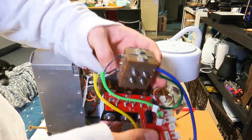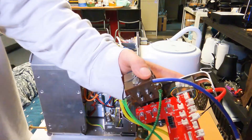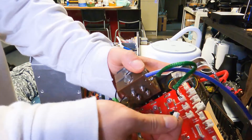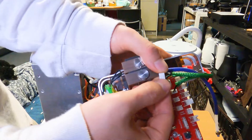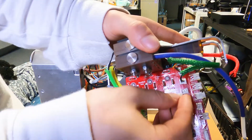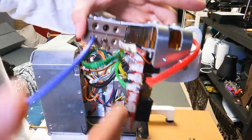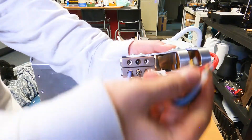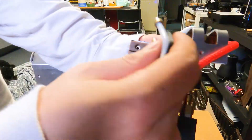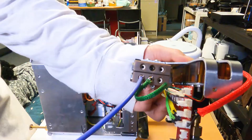Put the new manifold on here, align the holes up, then put the plate on and line the holes up, and put the two screws in. Those screws require a T9 Torx or hex driver. Now you need to put the sensors back — the sensors don't have sleeves but they have colors, so just match them. Dark green goes on top, yellow is in the middle. The protruding side faces the empty side, and the two holes go down.